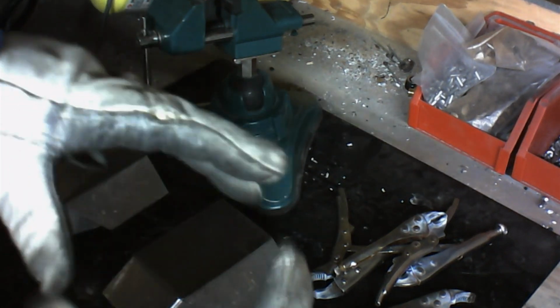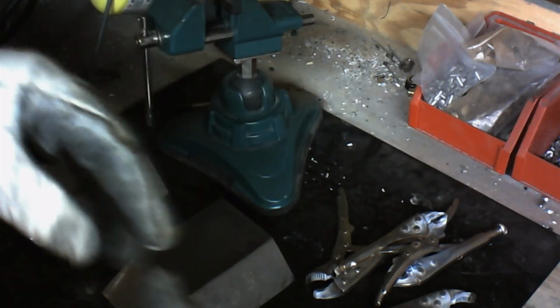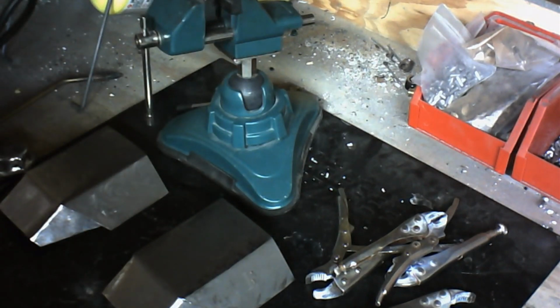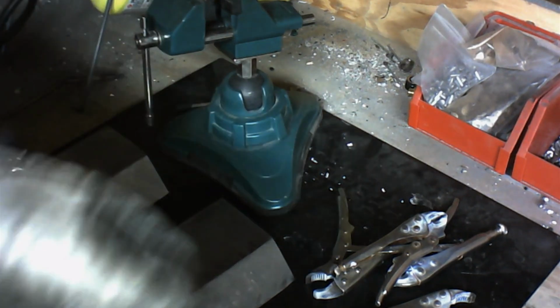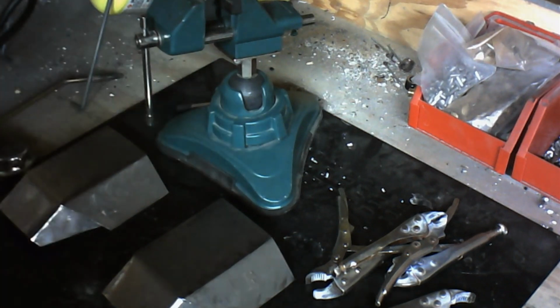Now, if you do use welding magnets, you don't want to weld right up to the magnet, because applying that much heat actually makes the magnet lose its magnetism. So they're mainly used to just join two pieces in one spot so that you can start welding in another spot and then take the magnet off, because you've got it already tacked together with weld or brazing rod.